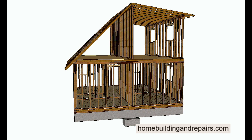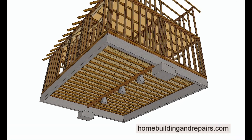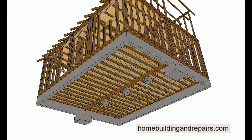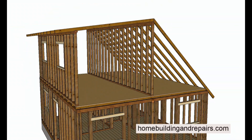Here's the last example: instead of using a post and beam setup, you would use a wall. The wall could require additional concrete work throughout the entire crawl space — it could actually require a footing that goes all the way across, and might require some additional framing, or require you to replace the beam in the crawl space area as well. The wall would help to prevent movement as weight is applied to the roof.